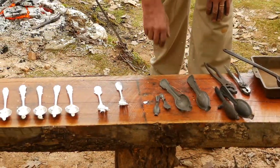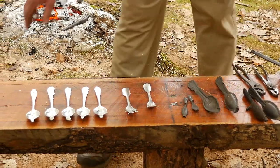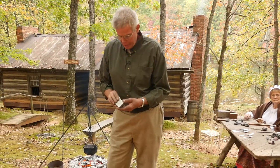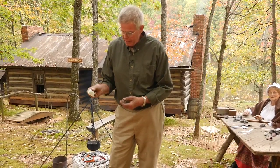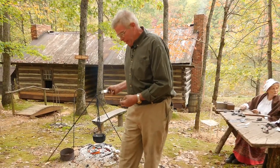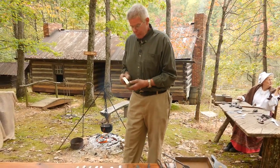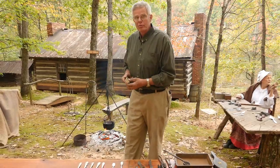What we have here today are 1800s molds — all original molds from the 1800s. Pewter comes in an ingot, most of the time two-pound ingots, and they are shipped to me directly. They are then put in the pot to be melted. Melting point is somewhere around 340, 350, and it pours very well at 400 degrees.